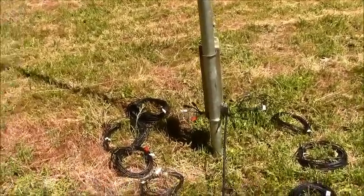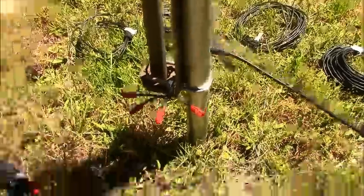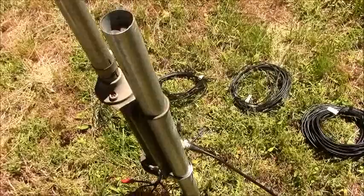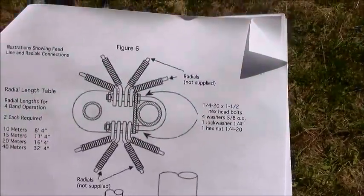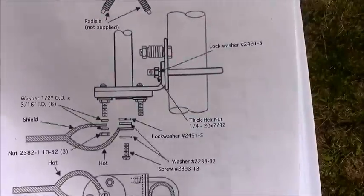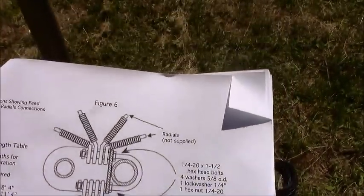When I first got this, the radials were just wiped out — they were all busted up, torn off, and basically non-existent. This is freestanding; you take a couple of these steel stakes, drive them into the ground, slide this right over the top, and that is a freestanding antenna. Let me show you real quick what I had to reconstruct. This is a diagram from the operator's manual that I printed out, and underneath there you can see how your coax cable is supposed to be connected — that was all torn up, and all the radials were torn up too.